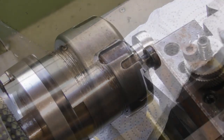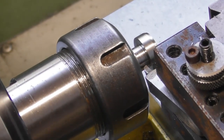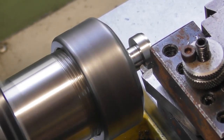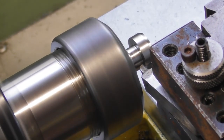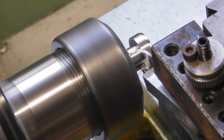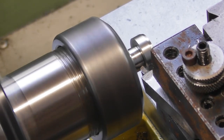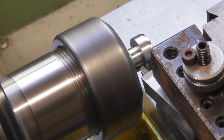This is a really difficult shot to get because it's a minute tight corner down in here, but I've got the tool down near the bottom. I'm bringing the carriage back and touching on that face, just machining it back until I get contact all the way along that face down to the bottom. I'll just nibble away at it nice and gently until I get that contact — you can see the general idea and that'll leave me with a correct angle.